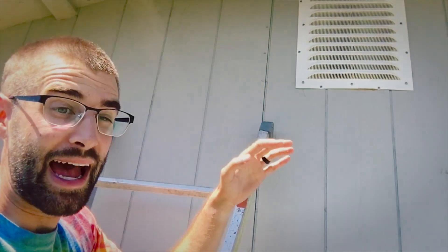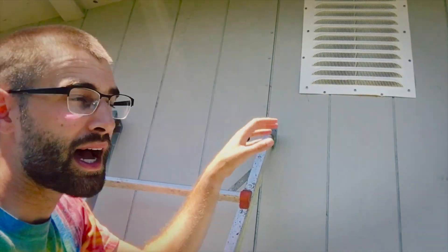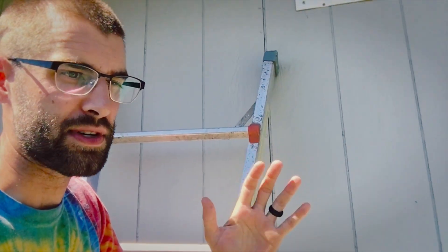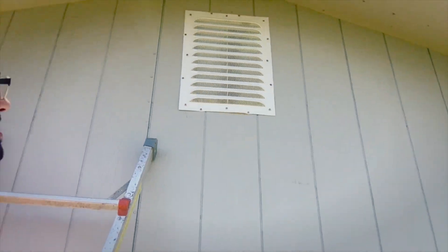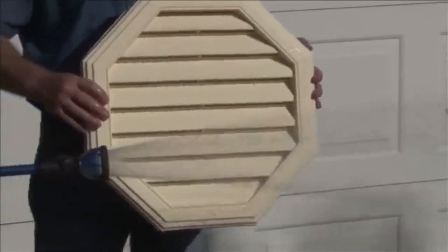Once it's cut out, you basically put one piece in from the outside and one from the inside. It is best to have two people so you can kind of force them together — it's not really possible to do this by yourself, you actually need something on the other side. Before you sandwich them together, put some caulk all the way around the edges — a generous amount.